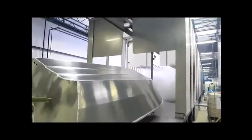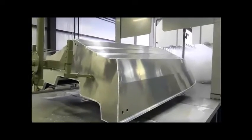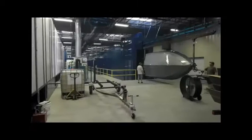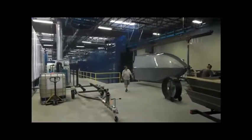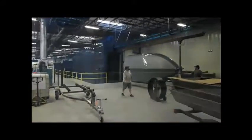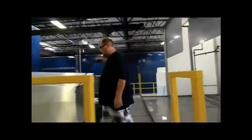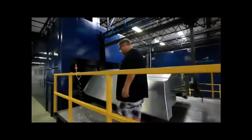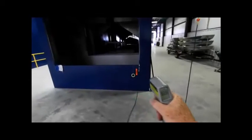It starts with a chemical wash. Even though the boat is unused, it still has lots of hands on it, and those hands have oil on them. A clean surface is a must, so this wash ensures a clean hull. The boat is suspended from a rack and moves through this whole process at 5 feet per minute, meaning Tracker can do 90 boats a day. Then the boat needs to be dried. A worker blows off all the nooks and crannies and gets the major water off before the boat goes into a short oven with just enough heat to evaporate any remaining water.